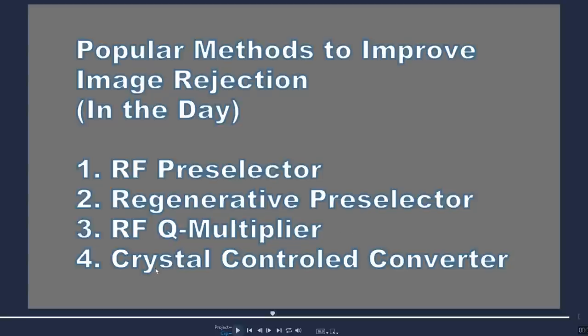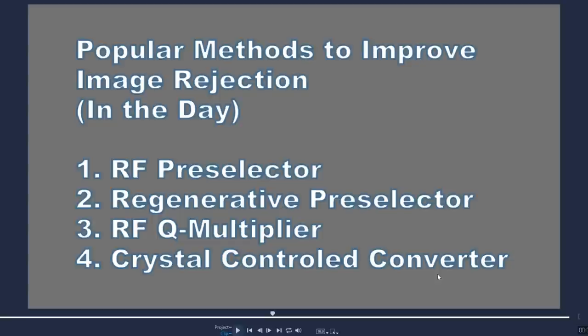Adding a Q multiplier to the RF tuned circuits rather than the IF tuned circuits is another interesting method — not found very often in RF circuits, but it does work. This is more difficult because it's sharply tuning and you've got to be able to band-switch it. The method I was most satisfied with is the crystal-controlled converter. It uses a tunable part of your receiver where you have good image rejection — like 40 meters — and you down-convert from 15 meters, 10 meters, or 11 meters down to 40 meters using a crystal. A good sharp resonant antenna tuner can also give you some image rejection improvement, but only 900 kilohertz away you're not going to get much.